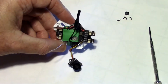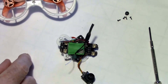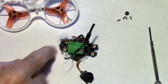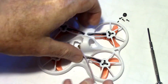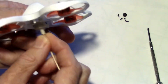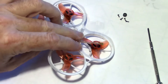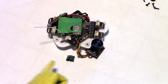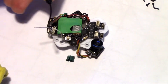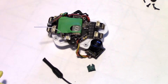I've removed the flight controller board with the VTX 03 video transmitter mounted on it — there's the camera. To prepare for installing the antenna, I need to remove the old one. I can cut the heat shrink that's on there and just remove the antenna. I cut that heat shrink and pulled it off, then the antenna was sitting there and I just used my fingernails to pry it off very carefully. So we've got the heat shrink and the antenna off.